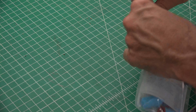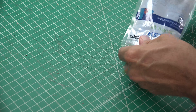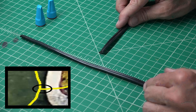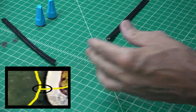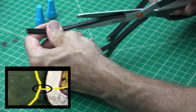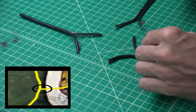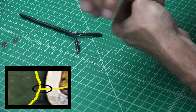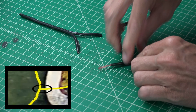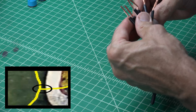Starting at the wire end, wrap in a spiral direction from the wire to the bit. Take note of the direction you are wrapping the tape — this will allow you to spin the drill bit if, while pulling it through, you catch or snag on something. Now, stepping back over to the other side, pull the drill bit all the way through until the wire is safely out on the other side. Then you can unwrap your tape, and you have successfully laid wire under your sidewalk.